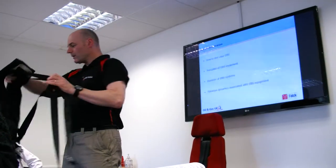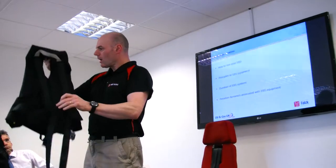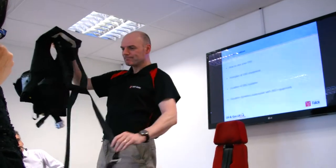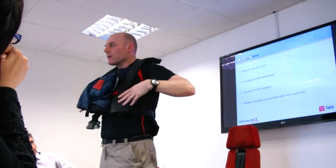This is a combined unit — a life jacket with an emergency breathing system built into it. To put it on, hold it in your right hand like so, take your left hand, pass it through the two straps at the back, and put your head right through the middle. And that's it.